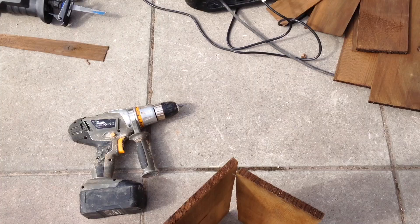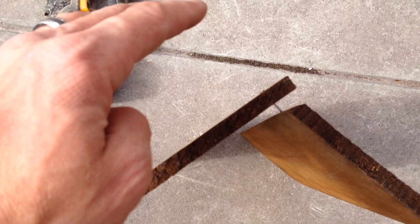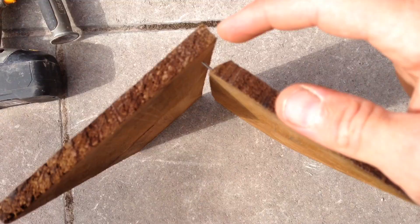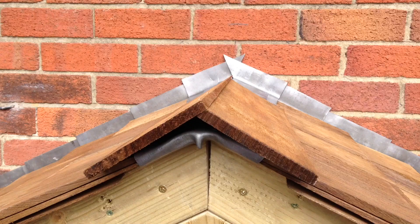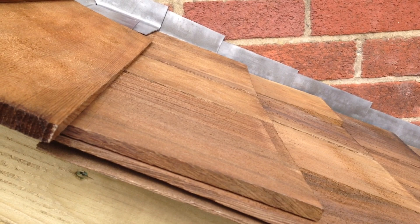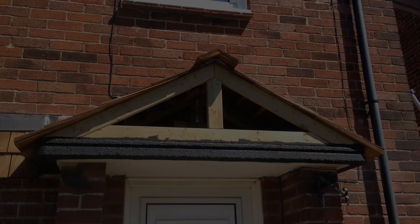This is how I'm making the ridge tiles for the apex. You place two shingles on the roof at the correct distance — still 15cm as before — and then plane off the angle required on one of the shingles. Then mark out the positions relative to each other, drill through with a very small drill bit and nail them together. This shingle overlaps the other one, and if you alternate on the next course above you'll get a waterproof apex. Here I'm placing the ridge tiles in position on the roof, getting my 15cm measurement on either side, and you can see any excess can be trimmed off with a hand plane at the same angle as the shingle. Here you can see three sets of ridge tiles complete.